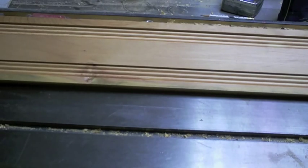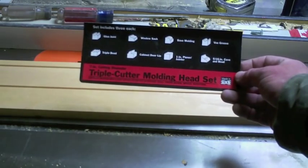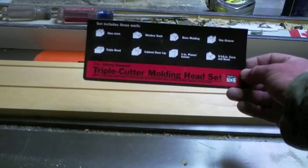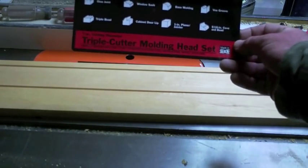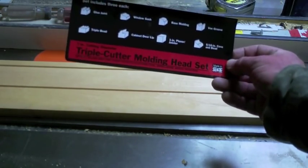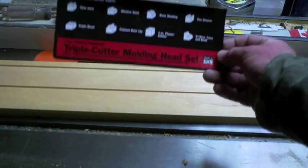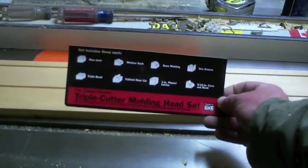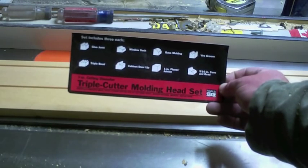That's the Craftsman tri-wing molding set. It's a pretty useful tool in a small shop. Single-cutter fly-cutter molding heads look pretty dang scary. I recommend the three-cutter version — if nothing else, you're sharing the workload and your cutters will last longer. I've never used a single cutter. This is what I recommend, this is what I use, and this is what I've never ever had a problem with.